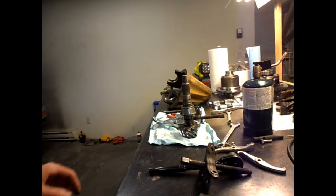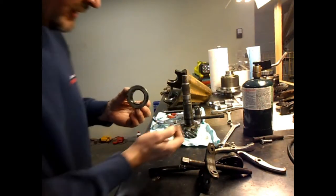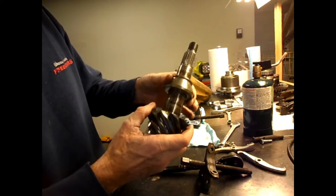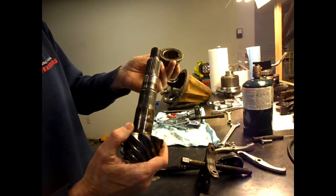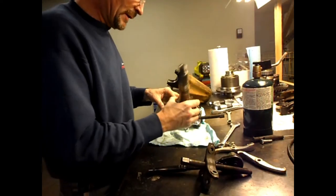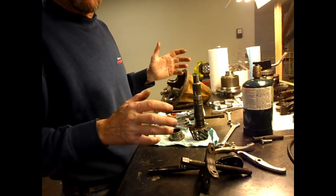No grinding with a grinder. The trouble is, if you grind this off with a grinder you can see how thick it is — if you nick this shaft with a grinder you're going to create a weak spot. You can use a grinder; lots of people do — grind it almost through but not quite, then take a cold chisel and snap it off. But if you damage this piece you might as well throw it away. So I prefer not to do that. It's not even too hot; I just had to get it warm enough to move. Four different pullers involved but it came off.